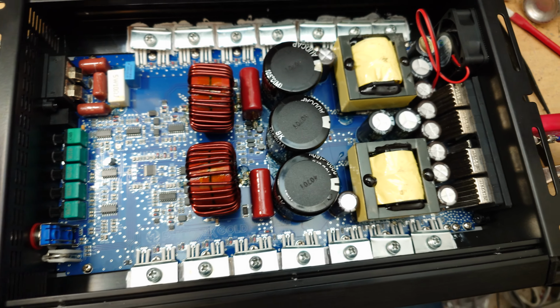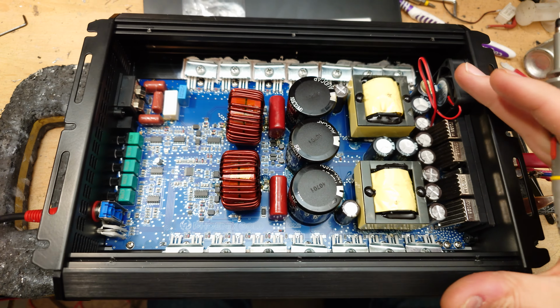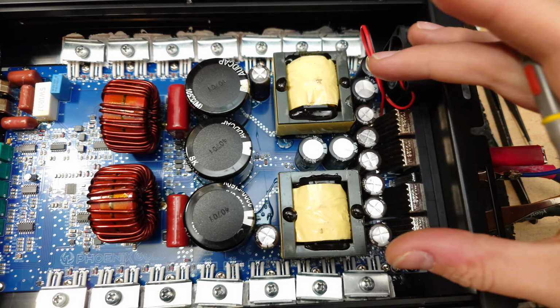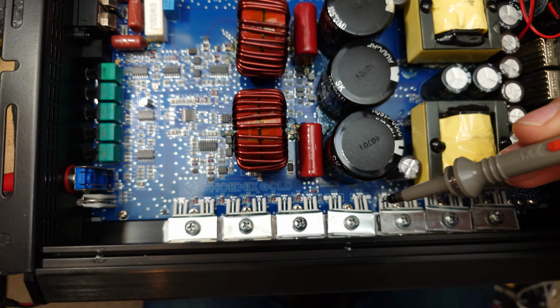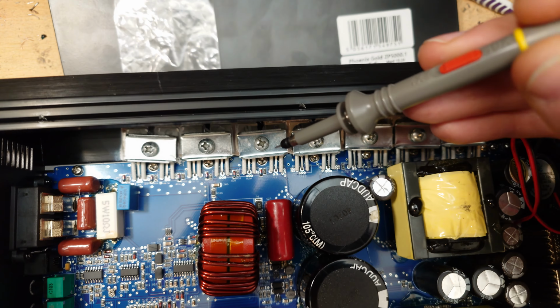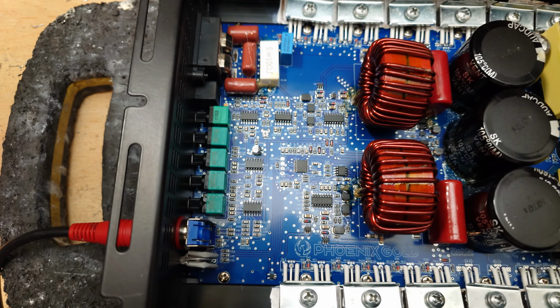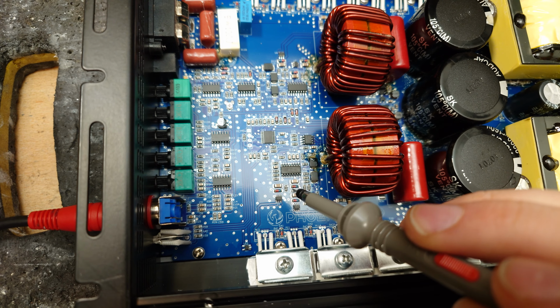So just quickly going over it, we actually have two sets of terminals, which is unusual in a 5K in this kind of smaller Brazilian style size. We have our two power supply transformers, we have our power supply MOSFETs along this side, we have 4 rectifiers here and here, and then we have our output MOSFETs. Now this is based on the 20957S drive architecture.